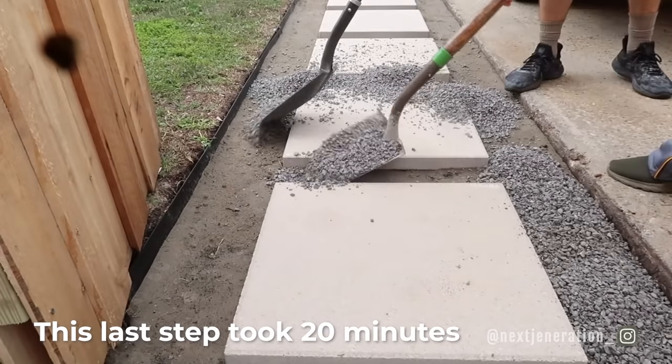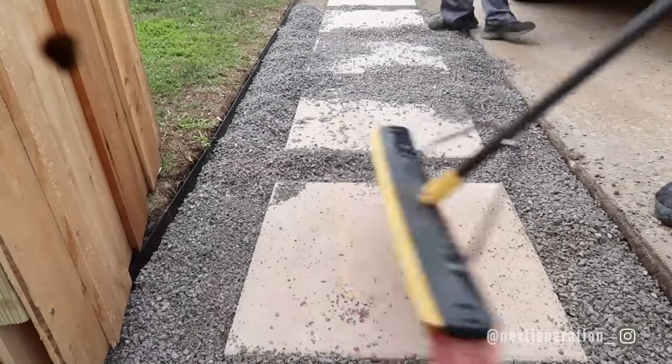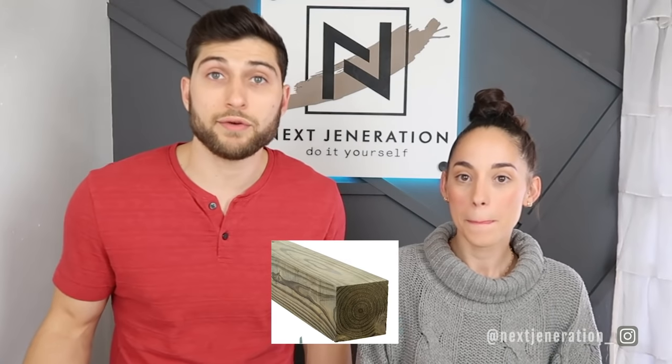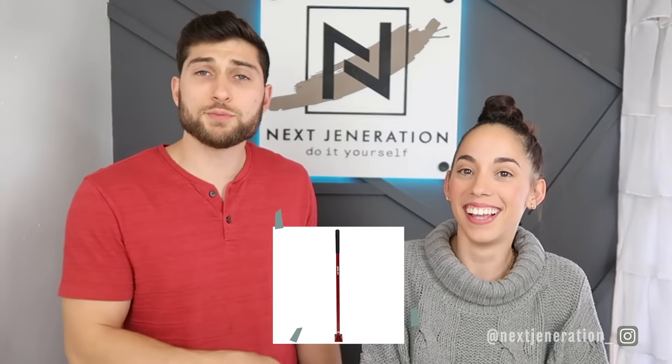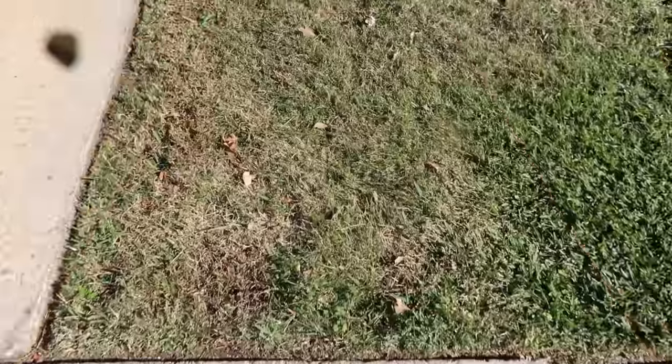One step left: the finisher rock. We went with a smaller grade of limestone for the top — the larger grade was cheaper so we used that at the bottom for drainage where you can't see it, and the nicer limestone for the top finish. If the tamper doesn't fit between the pavers and the concrete, use a four-by-four. They also sell smaller tampers — that's my recommendation.